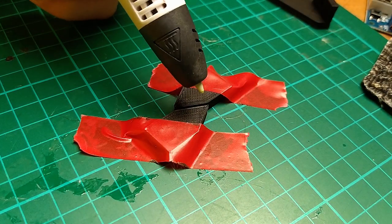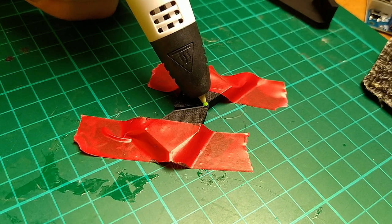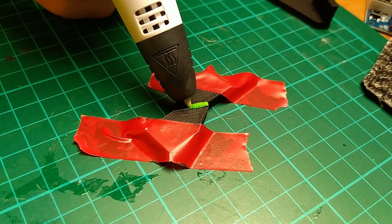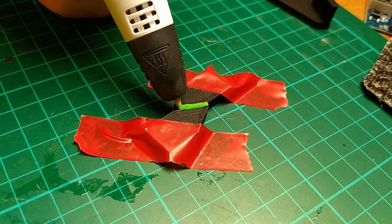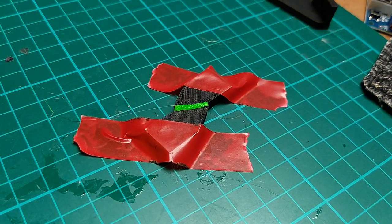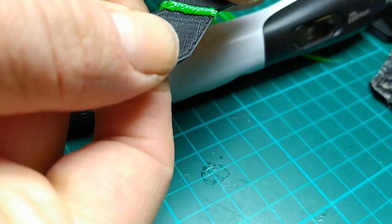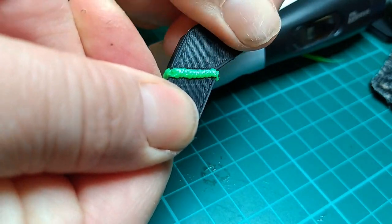So the 3D welding — using one of these cheap pens to bridge small gaps between parts creates a really, really strong bond. In fact, I now sometimes design parts with a wedge shape in them that allows a lot of surface area for the bead of the weld to be put in. The beauty of it is it slightly melts the workpiece, so it creates a really contiguous solid, if not the tidiest kind of joint. Really, really useful technique.